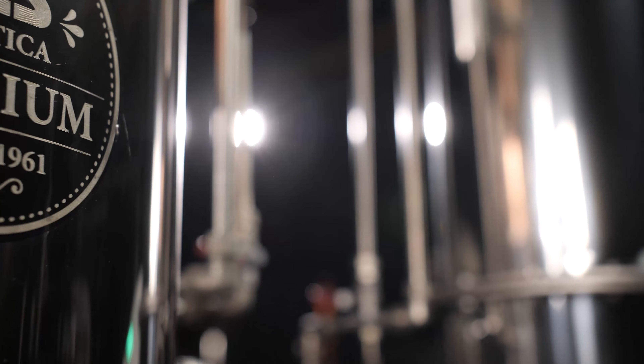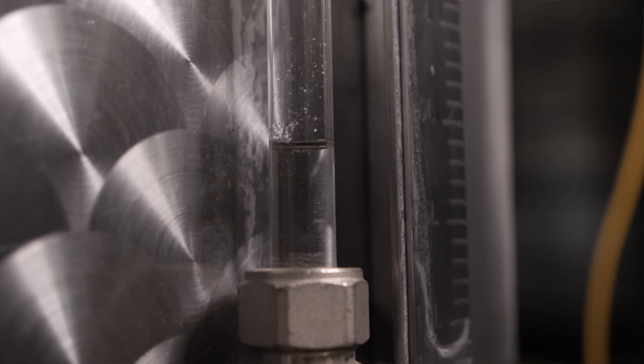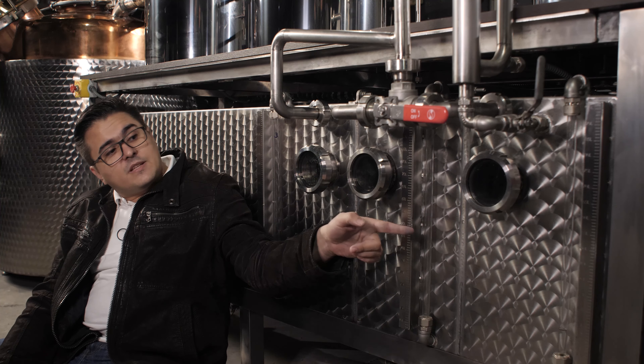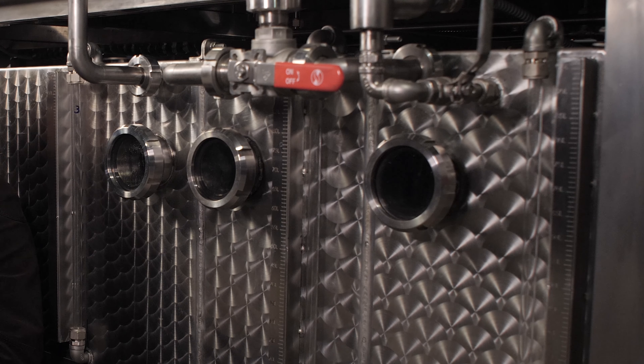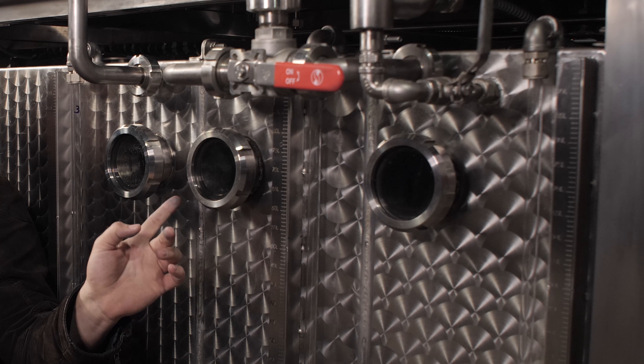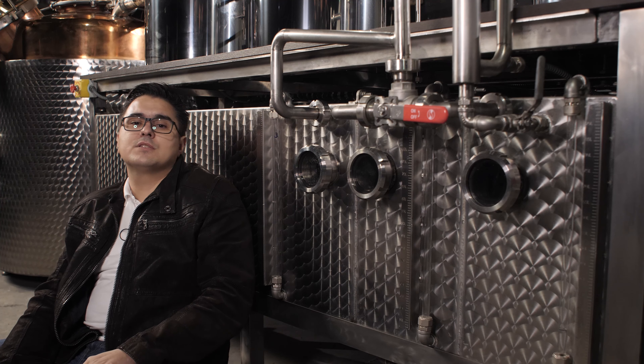Back to our vapor trail. Once the vapors reach the top of the column they go through the dephlegmator, through the gin basket, and into the condenser or cooling system. In the cooling system we have connected inlets for cold water and outlets for hot water. Since we have two dephlegmators, we have two valves — one for the left and another for the right column. The consumption of water may vary depending on your outlet source.